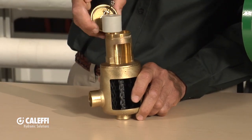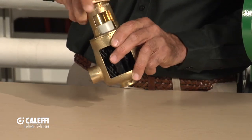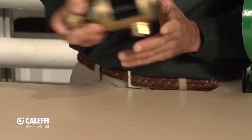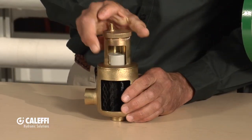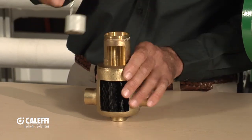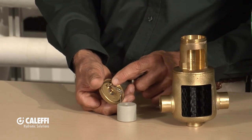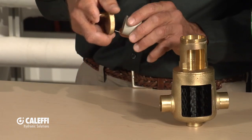There's a hole in the center of the float. The float rides up and down on a pin instead of just being on a hinge on the top. So when this is assembled and somebody puts it into a system a little bit off-plumb this way or that way, that float can still slide up and down — it's not going to rub on the side if it was just hinged. The pin allows that float to ride up and down. You can disassemble that, so if you get a speck of debris, dirt, copper shavings, or Teflon tape, you can get in there. You can take this to a faucet and blow it out and clean it out. It's very easy to service.